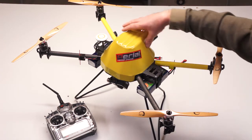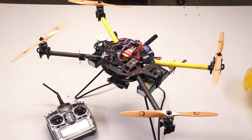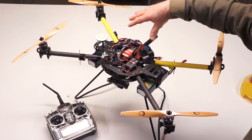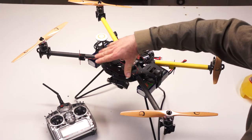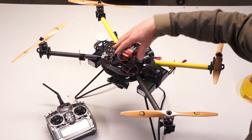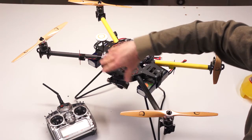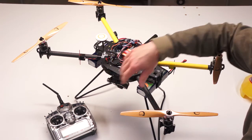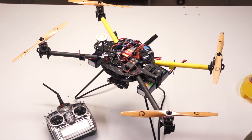This particular helicopter is what I call an XY-4; the frame is my own design. I've been flying this XY format for about two and a half years, and this version of the frame is about six months old. I call it an XY because it's an X like a quad, but it's also a Y — it has spacing in the front like a Y-copter. The front motors are 120 degrees apart, so the camera has a clear view out the front between the props and motors.